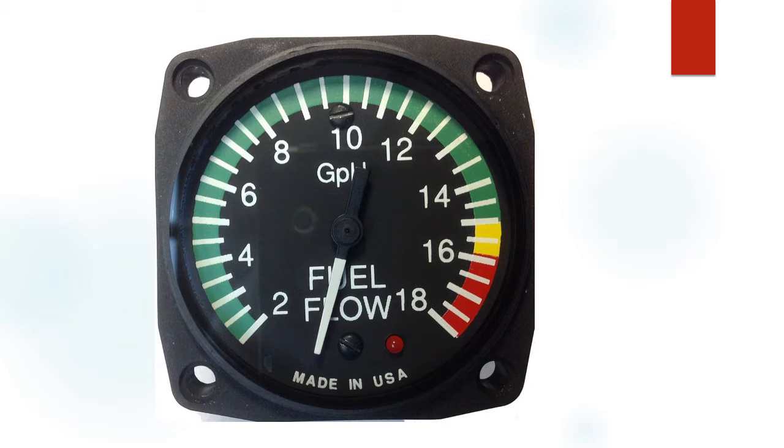As I mentioned, there are two alarms. One of them is this internal LED that you see right here. The other one is a contact that comes out the rear of the instrument on a DB9 connector. And it's capable of sinking a 40 milliamp load. I've designed all of these instruments to drive my crew alerting system and my master warning annunciator. But you can drive any load less than 40 milliamps.